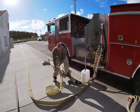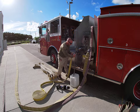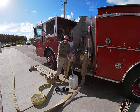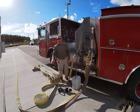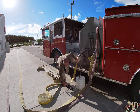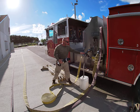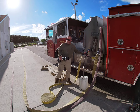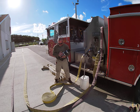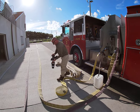Making sure that my pickup tube is no greater than 6 feet from the eductor. From here, we're going to connect our hose line with gasket and swivel. I want to make sure that I have at least 50 feet of hose, no more than 200 feet of hose from my eductor to my nozzle. I then connect my nozzle, making sure that my nozzle matches my eductor. This eductor flows 125 gallons a minute, so my nozzle has to flow a minimum of 125 gallons a minute.